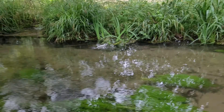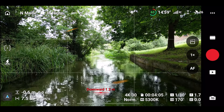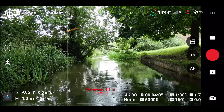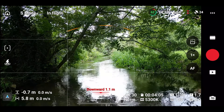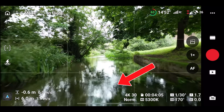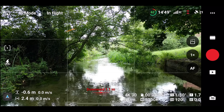It's not until we get to quick flying over water that the sensors seem to be inaccurate. I had the drone hovering at about 1.2 metres above the water and switched to sport mode so I could accelerate quickly. As the drone flew forward, the height reading increased by about half a metre and sometimes even a metre more than the drone's actual height. It was also interesting to see that the reading seemed to disappear for a brief moment when the drone was in fast motion, then returned once the drone slowed down.